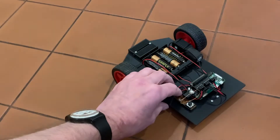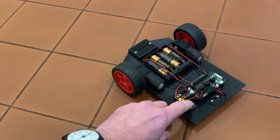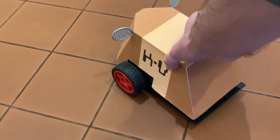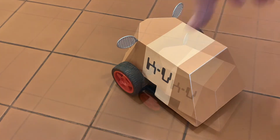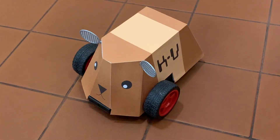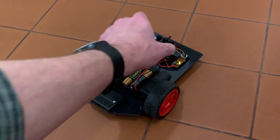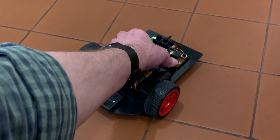Now when we come to use KV the robot guinea pig, we don't have to mess around reinserting batteries or reconnecting the power pack for the Raspberry Pi — just booting it up with the simple touch of a button thanks to the Pimoroni on/off shim. Then we can run the control program using SSH, which I covered in another video, and finally isolate the power pack and shut down the Raspberry Pi, all without connecting a single cable.